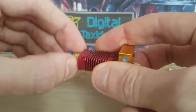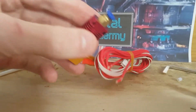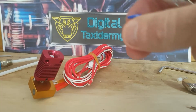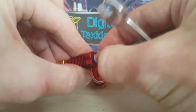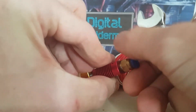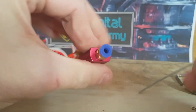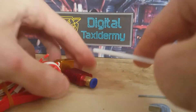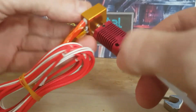One thing I did forget: when you go to install this, what you really want to do is place a bit of filament down and place it in there so that it lines up the Bowden tube with the connector. So then you know that it's all in line. Make sure that there's a bit of filament in there, and then you can just put your Bowden tube in the top there as per normal. So there you go — that is a hotend fixed with Bowden tube ready to go.